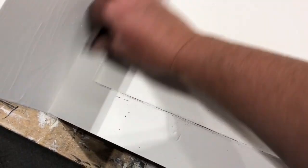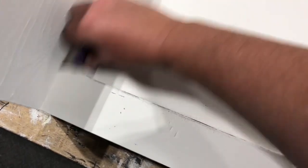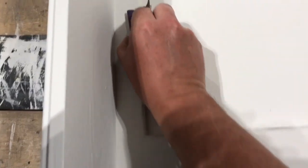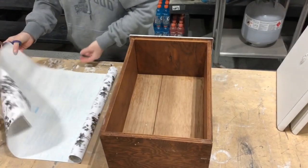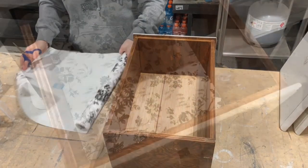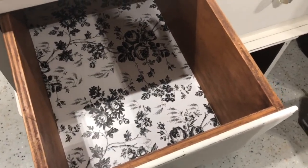After the white paint thoroughly dries and achieves three or four coats — depending on coverage — we go through and distress the edges, where you can see the black showing through. How hard you push the sandpaper determines whether the black or the natural wood shows through. To protect the white paint and finish the piece, we use Minwax Finishing Paste. The bottoms of the drawers were homemade or had fallen out — they were a paneling piece — so to tidy them up, I used black-and-white contact paper that I get at the dollar store or Amazon.